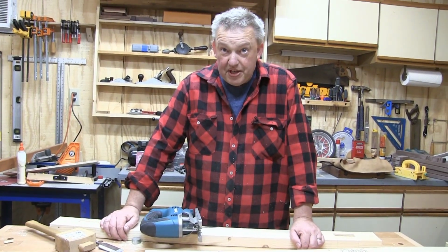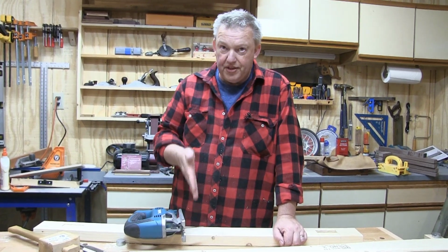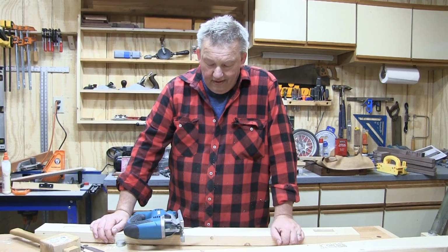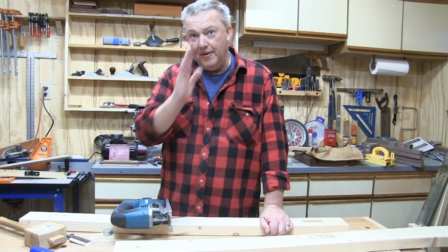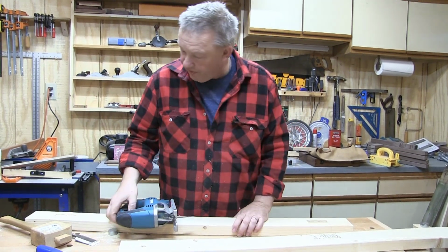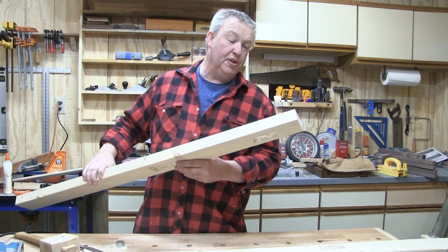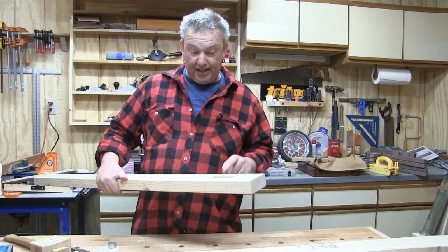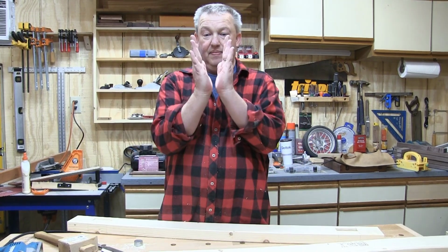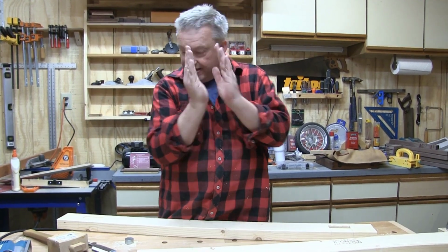They're all right for thin material, you know, and for cutting shapes and scrap. But if you try and do stuff on thick material like I'm doing now with 1.5 inch, they always wander off and you end up with holes this shape. And that was the case with the first hole I cut. I tried to get rid of most of the material with the drill bit and then go in with that thing to square it out. And what I ended up with was a wedge shape like that, because the blade just bends.